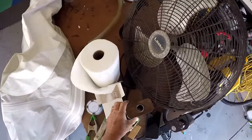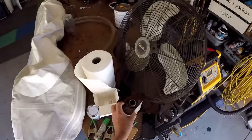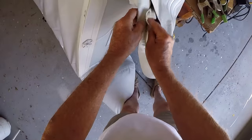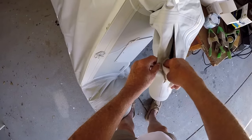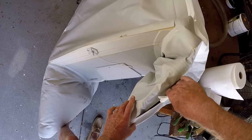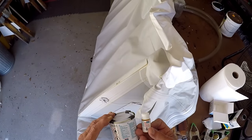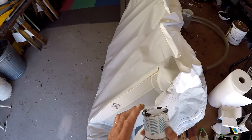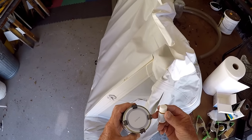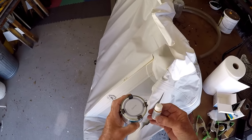So I did this 5 minutes ago. They want me to do it again. And then, 10 minutes, then brush on the first thin coat, leave 20 minutes, and apply a second thin coat, while still tacky, pressing together with as much pressure as possible. This particular kit has a hardener and the adhesive at the ratio of 1 to 25. And no, of course, no way to measure such a 1 to 25 ratio. But we'll figure that out.